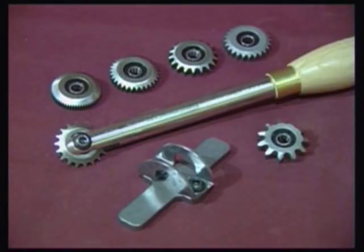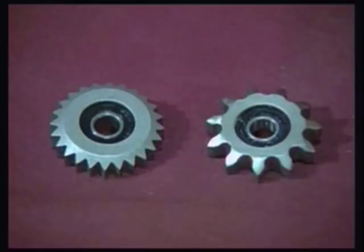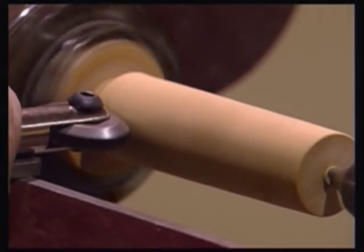The 330H kit comprises the tool shaft and handle, the texturing cutter we were using earlier, and 3 sizes of spiralling cutters. These are referred to as being 2, 4 and 6 mm. This simply denotes the size of the spacing between the teeth on the wheel in millimetres. This shot also shows 2 additional cutters that are available as optional extras.